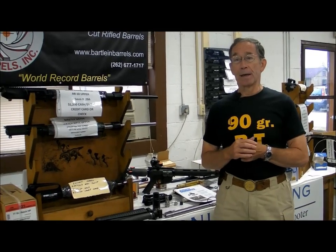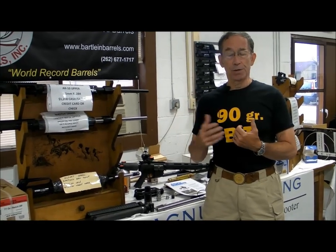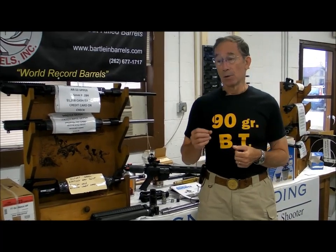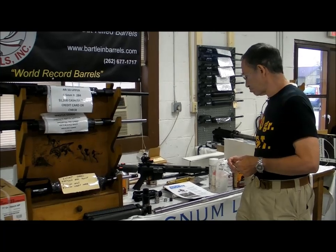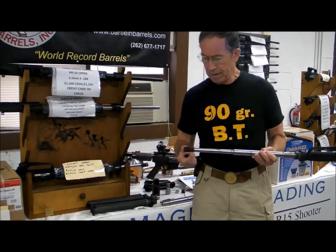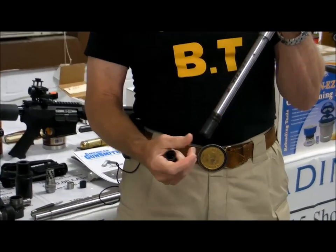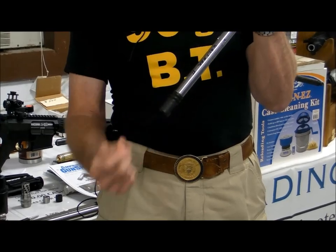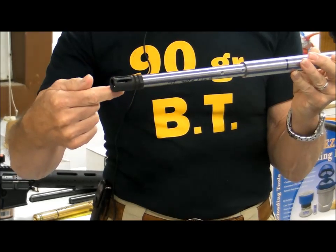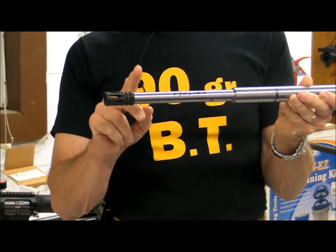One of the first techniques that the AR-15 community as a whole used to tune barrel harmonics in the AR-15 was to manipulate the flash suppressor. Using that technique, we started with the A-1 flash suppressor. The A-1 flash suppressor does not have a filled-in area — it has flutes all the way around the outside, which makes it a very good flash suppressor to use when tuning barrel harmonics.